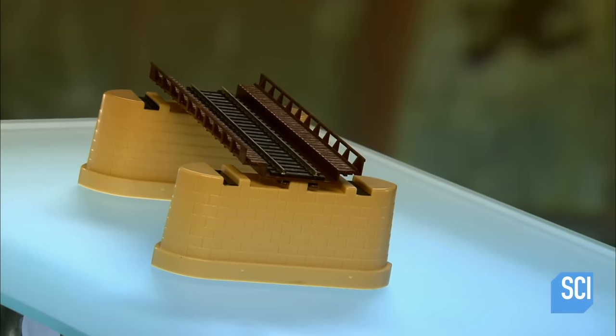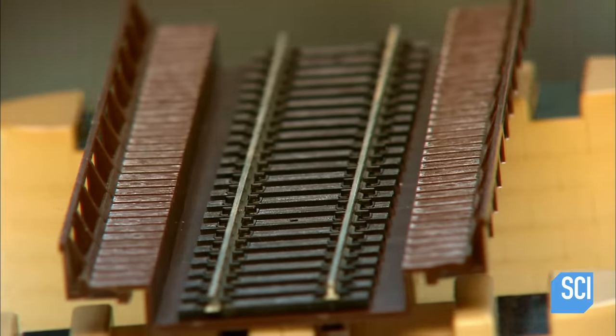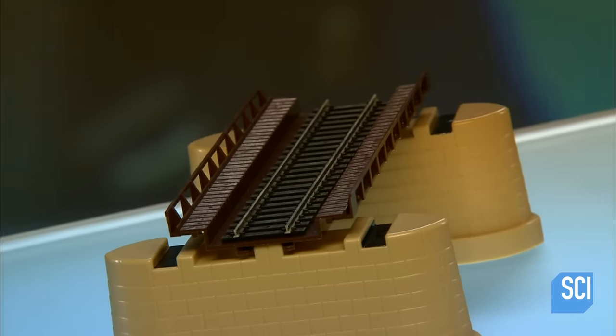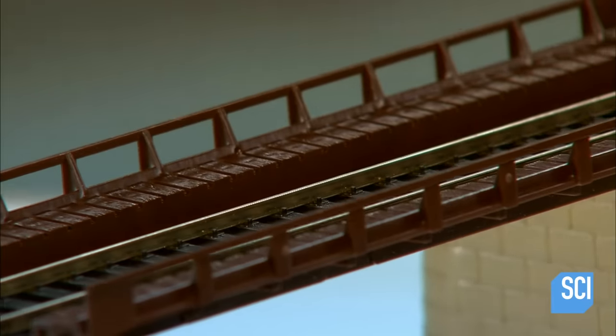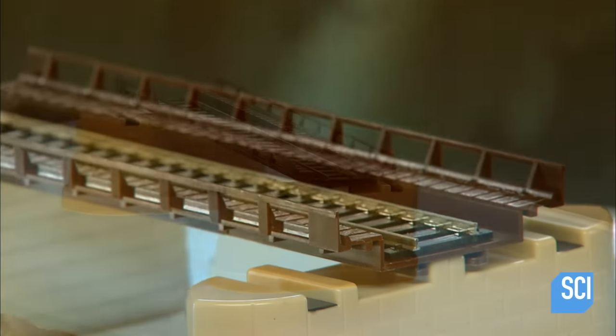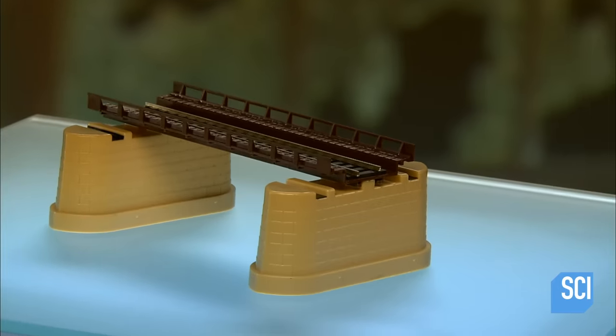The deck of a railway bridge is typically built of wood timbers called bridge ties. They're bolted to steel support beams located on concrete piers over the water or gully below. The rails on which the train travels are bolted to the wooden ties. Wood absorbs the noise and vibration of the passing train.